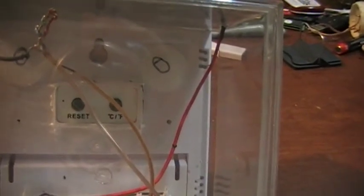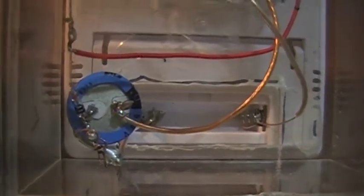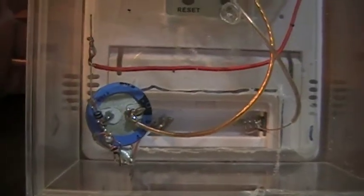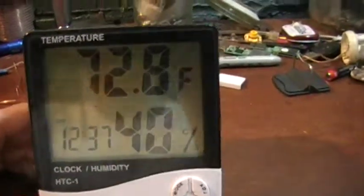You can see there's a couple of controls in there — a Celsius and Fahrenheit function, and a reset. Down here, you can see I eliminated the battery altogether. It doesn't even need a battery. I used a 5.5 volt, 1 farad ultracapacitor. Just sitting on my desktop here, it stores enough energy in that supercap to keep this thing running.